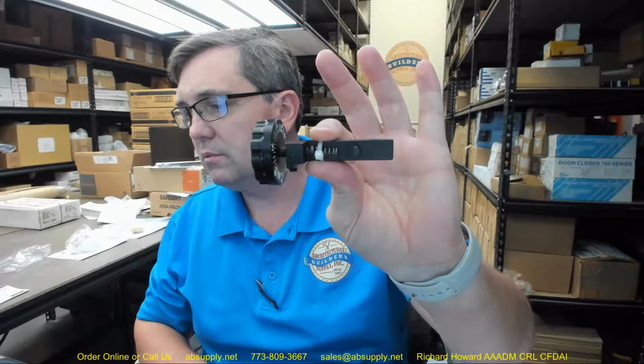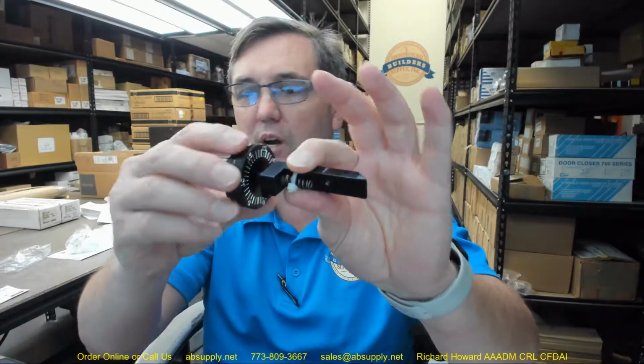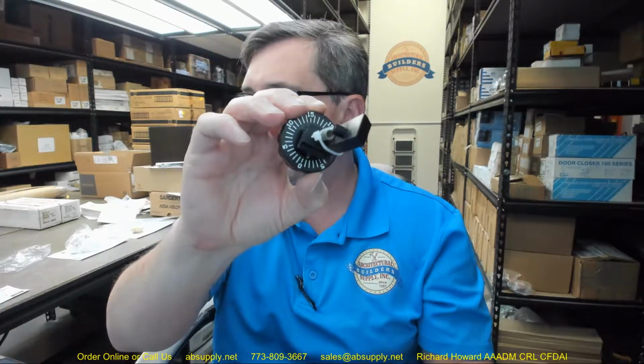Okay, so the RY200 key duplicator. The RY200 is based on the RY100 machine with a new cutter wheel, 4-way vice jaws, and is equipped with this micro adjust stylus. You can adjust your stylus to better than 1 or 2 thousandths of an inch at any time, and your machine can be returned to its original position just as fast. There is a parts manual down below here as well for the RY100 and 200.